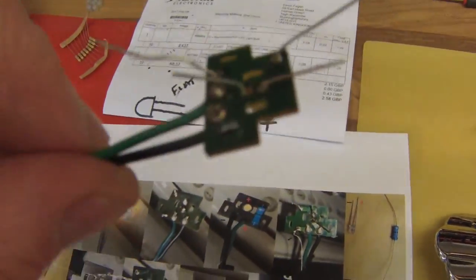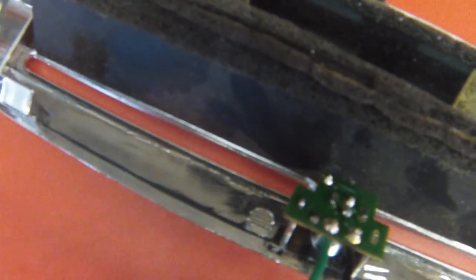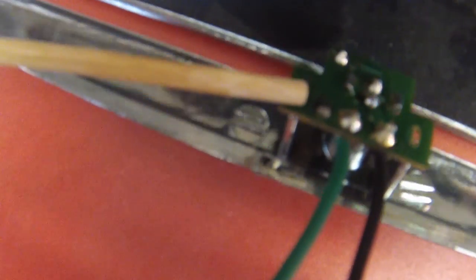So nearly ready for soldering now. The printed circuit board is now finished - got the new LED in there and the new resistor. Obviously that now needs to be inserted into the back of the unit. What I noticed is that Simon's put a couple of blobs of Araldite on these little tags here, and in fact this one's broken off, which is one of the reasons I think this board was not even attached to the assembly. So I'm going to Araldite these two areas here before I put it back in.